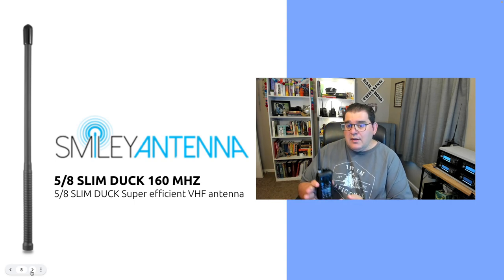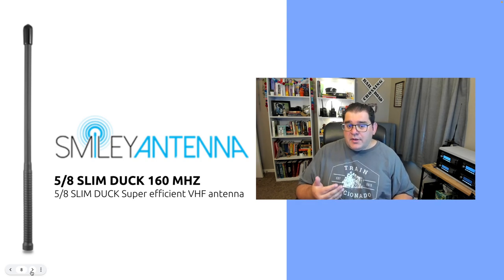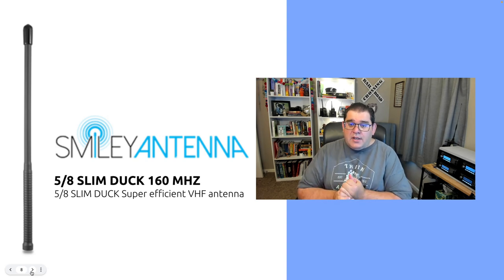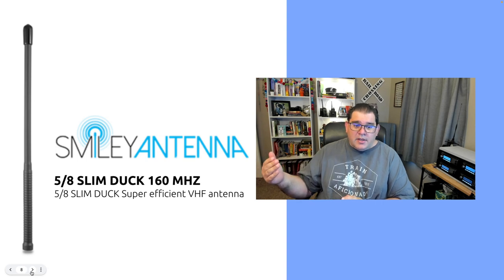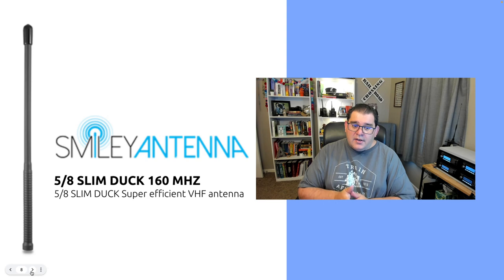So Smiley Antenna, a whole bunch of people that have taken my classes at the Cincinnati Railroad Club in the early spring purchased these antennas and been blown away. My dad, I got him one of these antennas. He's got the 125 AT, and he was completely thrilled. He said, I'm able to hear a detector that I was never able to hear before. I'm hearing a lot more of the crew communication, and I'm hearing some of the additional towers that are further away. So it kind of brought in a lot more. And of course, it's a tuned antenna to the railroad band. Anytime that you're using an antenna that's tuned to the band you're looking to monitor, it's going to be great.